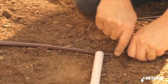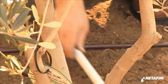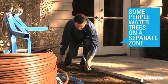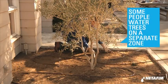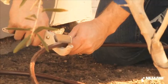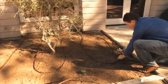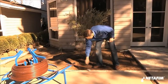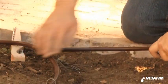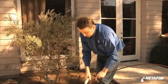You're doing the same process all the way through. This will all be covered with mulch — you won't see any of your irrigation like you typically would with spray heads. We're just trying to keep a continuous loop. When doing a loop or snake layout like this, we always want to loop it all the way back to our stub-up. You can see we're not using very many fittings on this whole planter bed — it's less expensive and also less labor.